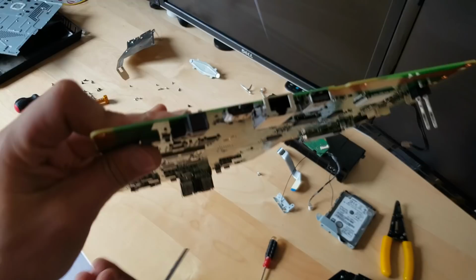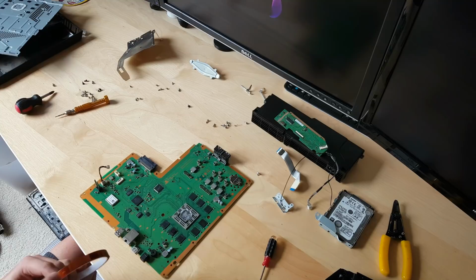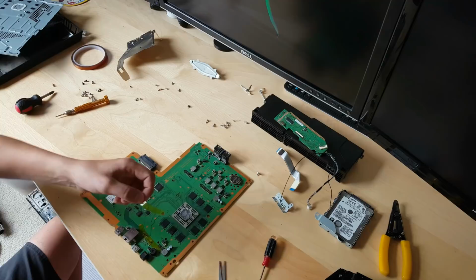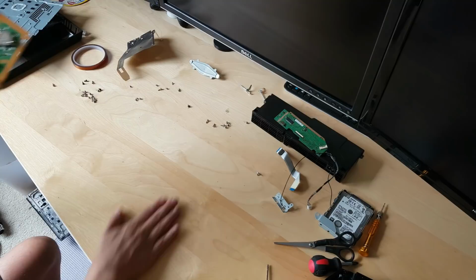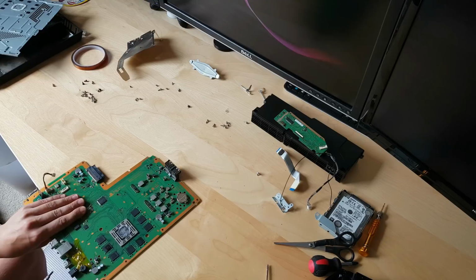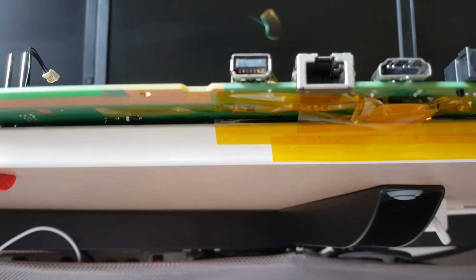So basically, right now what we will do, we will cover all the microchips around with thermotape. So now we need to heat it from the bottom and use the pliers and pick it up. So right here you can see, cover it all up. I put stoppers, put thermotape under too, so I do not damage the table.